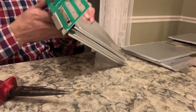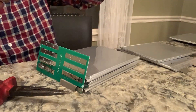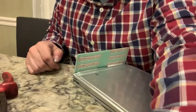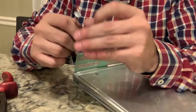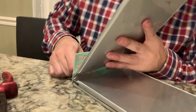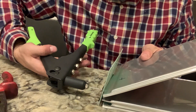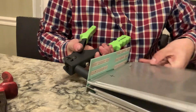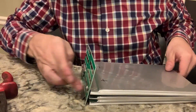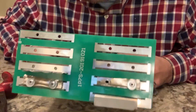Once I do that I get one of the tiny rivets - these are aluminum rivets so they conduct electricity a little bit better for a better connection. I'm putting a little washer on there. There's nothing special about these, I just got them from the hardware store - just made sure I got aluminum. You press it in, use the rivet gun - just squeeze it, turn it, and it'll pop off. Just check to make sure it's connected on the back, make sure it's not loose. And there it is, the rivet's done.